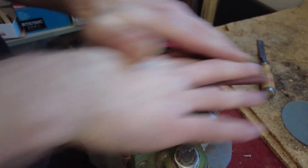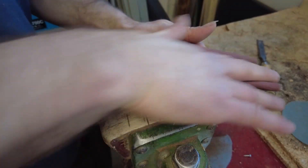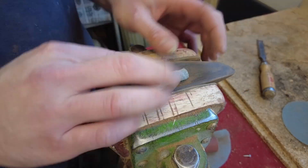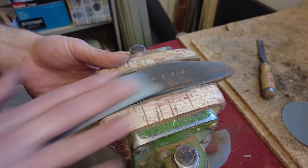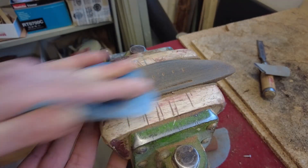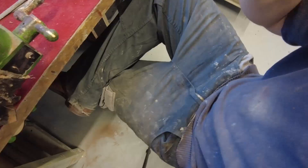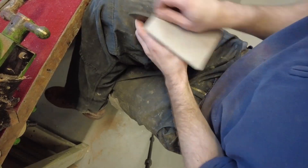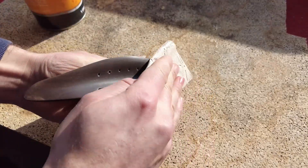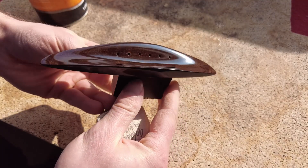I also need to sand all the surfaces because the CNC is precise but the drill bit presses down the material, changing its color. I need to sand off maybe 0.1mm of material on the top to make it nice and clean, fine sanding it so I can use my French polish. If you're not polishing, you can just sand it up and maybe use a polishing compound. Basically sand to a high grit, then put on some oil, wait one day for the oil to cure, and then finish with French polish.